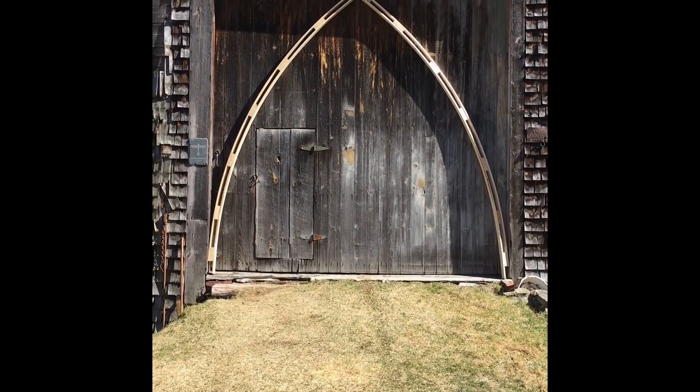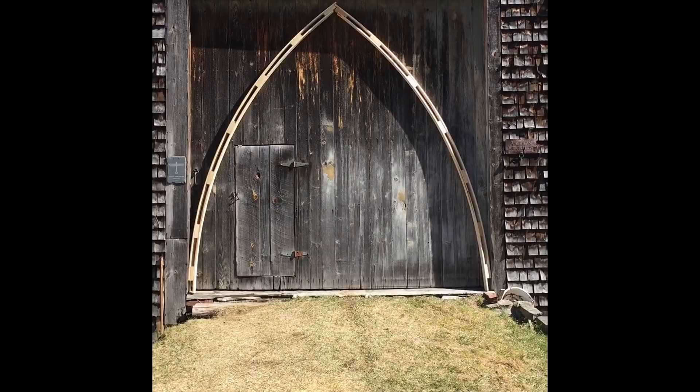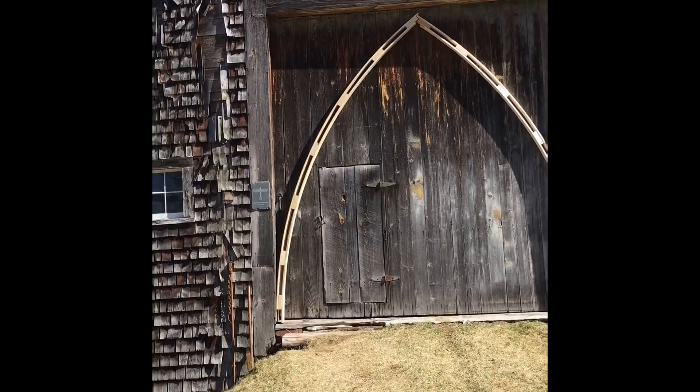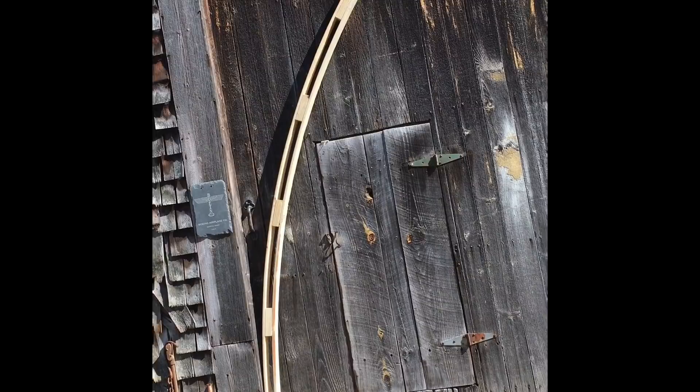In this video I'm going to show you how I made the arches for a gothic arch greenhouse project that I'm making. This one's going to finish out 12 foot wide by 20 feet long, so I'm going to have to make 12 of these. I'll show you how I made each one using a piece of 12 foot strapping for drywall and two by fours, all screwed and glued together.